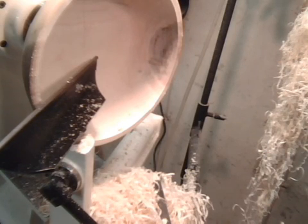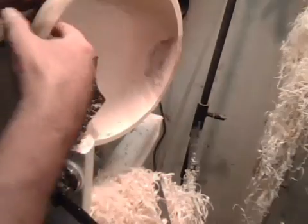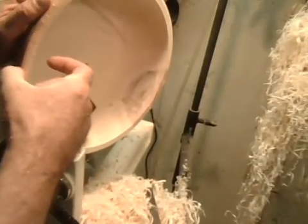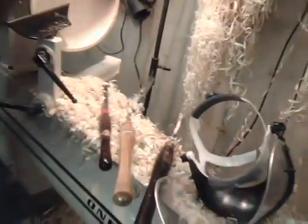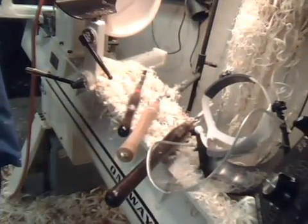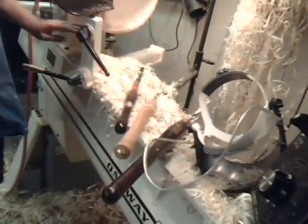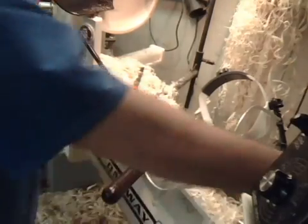Gregory. How do I dry my bowls? Well, let's take a step back, okay? I turned this one just to show you how I do the inside. But normally you'd have a 10% wall thickness. I would take it out, and I use Anchor Seal. It's made by UC Coatings. You can go online and order it. You want the original Anchor Seal and not the second generation or Anchor Seal 2 or whatever they're calling it.